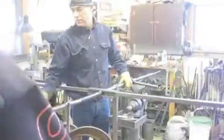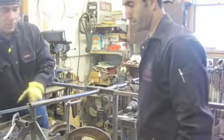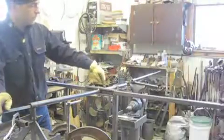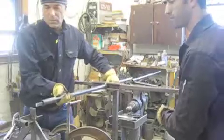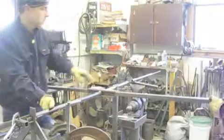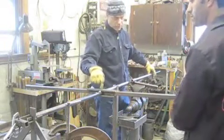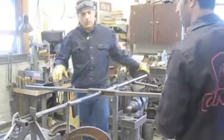We're going to load one up. Put a fresh bar in — let's do this one so you can see. Over here I have a square punched hole, half inch. Right inside here I have a square punched hole as well. Load it in. We have a pivot point here. We mark the top so we know how many revolutions we're going to turn it. This is our pivot and a little pusher to push the bar into our stop. We're good to go.